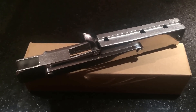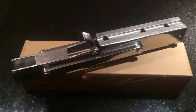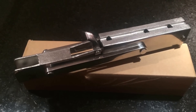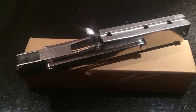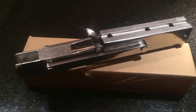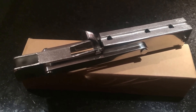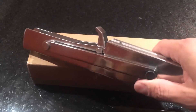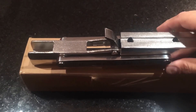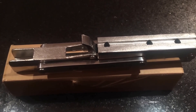I found this piece of hardware specifically made for that application — a folding seat bracket made by a company called Boat Outfitters. This is the only one I could find specifically for this purpose that was rated for marine use. There are some fold-down brackets made for tables or shower seats, but this one is actually made for boats. This must weigh five pounds easy — it is incredibly heavy material, three-quarter inch investment cast stainless steel. It's certainly going to be the strongest aspect of the boat.